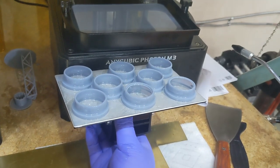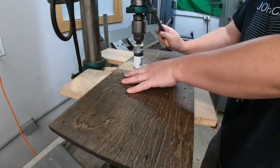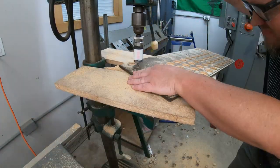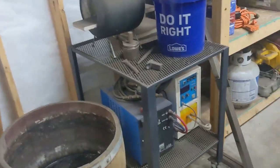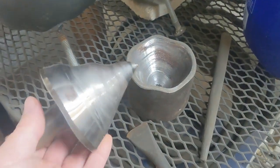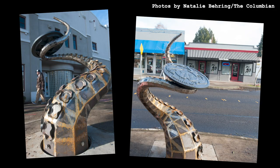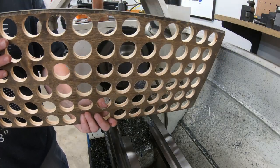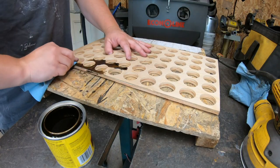While printing many batches of collars, eight at a time, I could finally assemble the racks. I didn't like the chip-out I was getting in the experiments, so I tried drilling pilot holes and then using a hole saw from each side. As an added bonus, that way it made the plugs much easier to remove between each hole. I still wanted to sand them after drilling, and I wasn't sure how to efficiently do that, until I remembered the cone mandrel I made for forging all the tentacle suckers on my visitor's sculpture back in 2015. With some sandpaper glued on and mounted in the lathe — in a collet, of course — it made the job much easier.